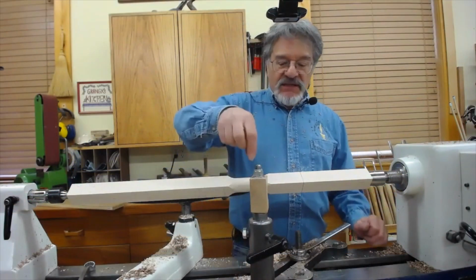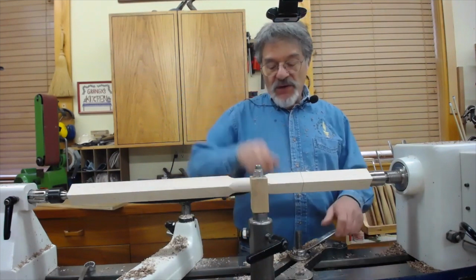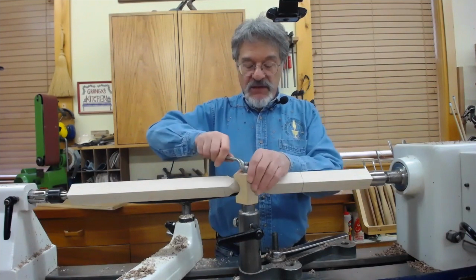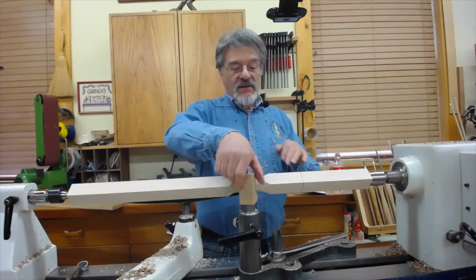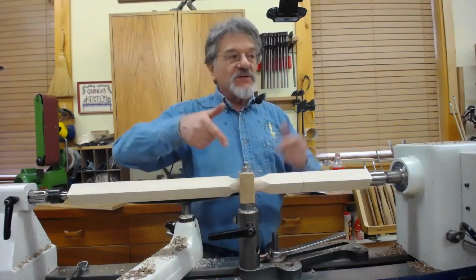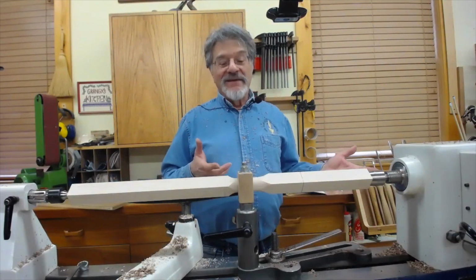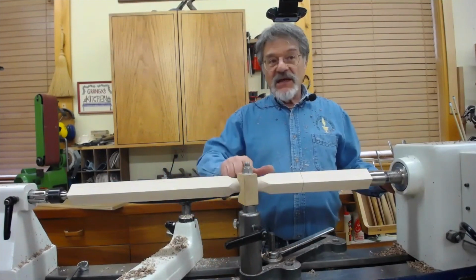Here. So this nut is tightened to where this still has freedom to swivel. So when you bring it up, it's self-aligning. Loosen this just, when the weather changes, you have to make little adjustments. The grain on the shoe is horizontal. Okay. So when I bring this up, it's self-aligning. But what I need to do the first time I use it is adjust the height. And once I've adjusted the height, now I never have to mess with that again. Right? Because every time I bring this up, bang, it's going to hit there. So I touch the sandpaper on here, right?